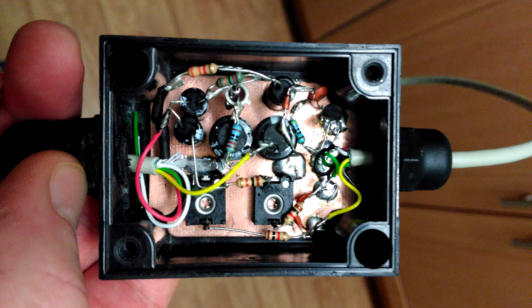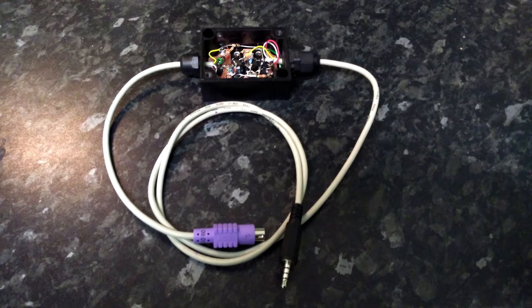Here's a picture of mine — it's hardly pretty, but it's dead bug style and very functional. As per the design you've got two trimmers on the bottom of the photo — two variable resistors. The one on the left is the volume control for the received audio, and the one on the right is for the transmit audio. This is connected to my mobile phone or tablet through a four-pole 3.5mm jack plug that goes into the headphone socket of your tablet or phone.